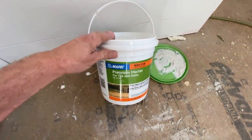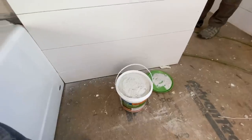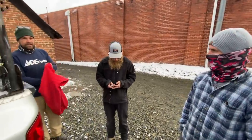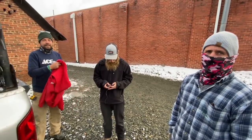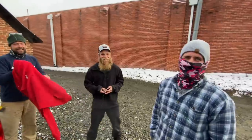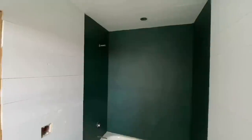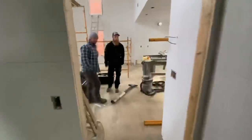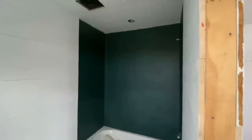I'm going to slick a little bit of tile mortar over the fiberglass tape — I bought some pre-mixed stuff for convenience and I'm just putting it on with a little trowel. We've got four guys, two bathrooms. We're going to break up into teams. Ray's going to be by himself and we're going to have a race to see who finishes first. The green waterproofing membrane has been put on, everything's sealed up, and now we're just going to stick a bunch of subway tiles.